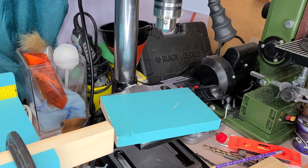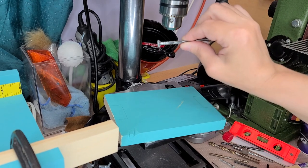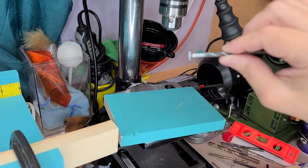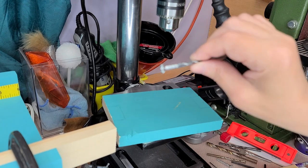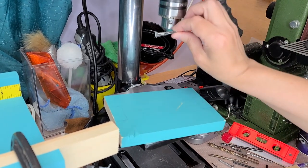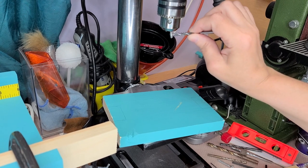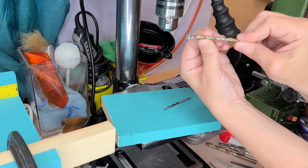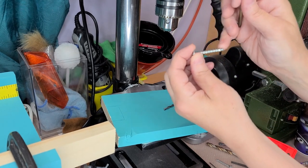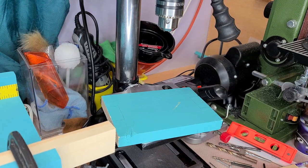Now I want to find a screw and drill a hole in there. When you're picking your drill bit size, one thing my dad told me was — when you're holding your drill bit, you want to make sure you can see your teeth. You don't want it to be so big that when you hold it like that you can't see your teeth. When I say teeth I mean your screw threads. So measure it that way, or you can read the box and see what it tells you to use. I'm going to change the drill bit.